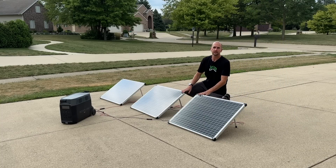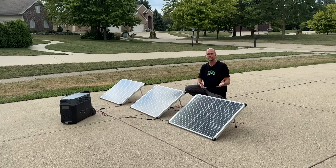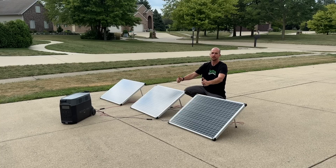Factor number one is the direction of your panels. Most of you are in the northern hemisphere, so due south is going to be your best positioning. If you're mounting on a shed roof you might be limited — maybe your due south is completely shaded. Just know that if you face east or west you're looking at a reduction of about 15 to 20 percent of overall power output compared to south, and if you have to face north it can be up to a 30 percent loss.